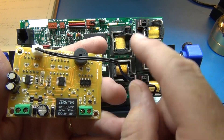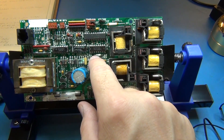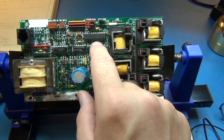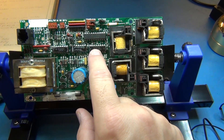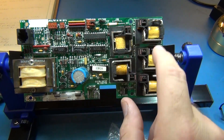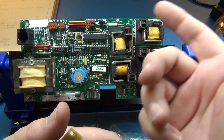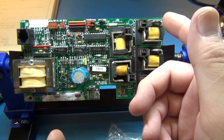There's another option. There's the control chip on here which I believe I can still keep powered. I can cut some traces and simply control the control chip on here, and this control chip will in turn control these relays based on the inputs of these controls. That will also give me an easy way to flip a switch to control this chip to turn the high and low jets on.